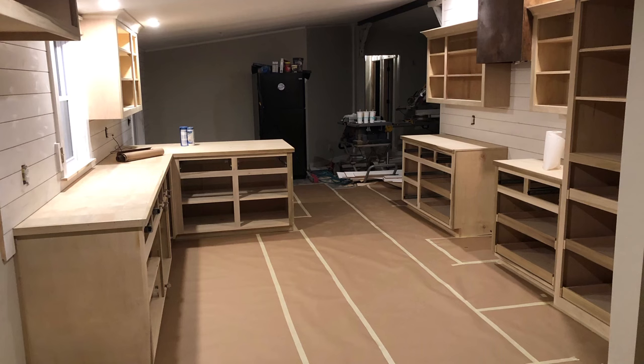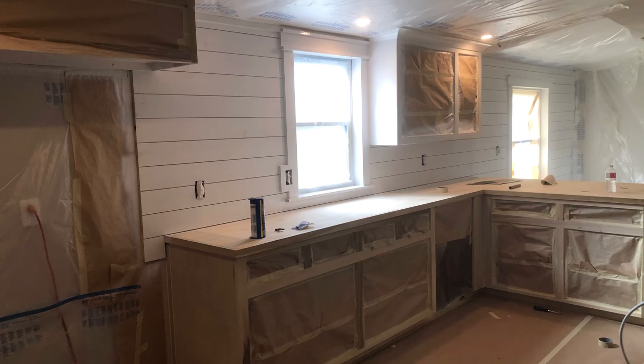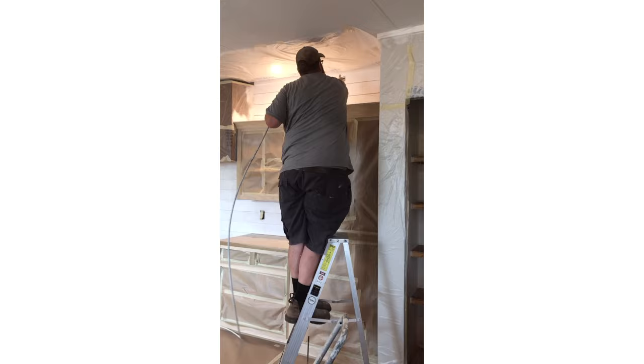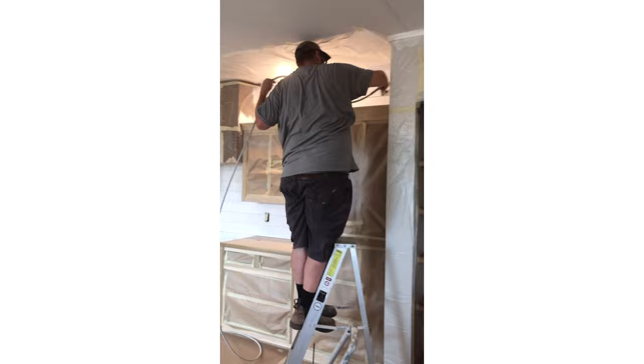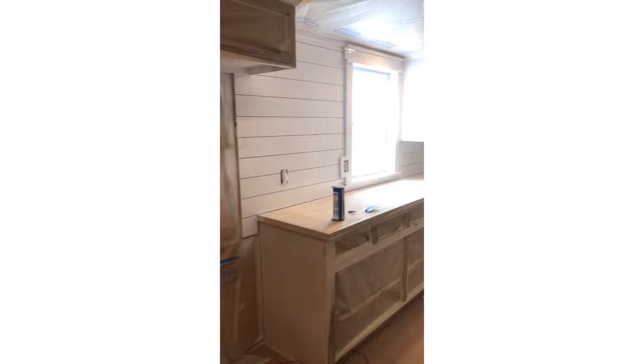Since I had the choice, I wanted the interiors of the cabinets to stay wood, so we taped and papered the inside of the cabinets off. After throwing on a coat of poly, we sanded and did another coat. My husband came in with white paint, spraying the shiplap and the cabinets. We used a PVA primer because we had it from the drywall, then did a satin interior as the top coat. I wish we would have used better quality paint — we used what we had on hand to be budget conscious since all the investment went into the cabinets themselves.